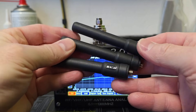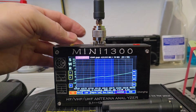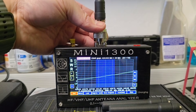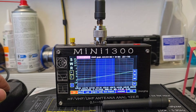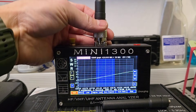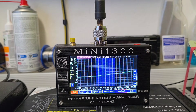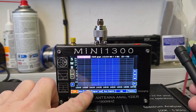Let's see how different three identical stubby antennas are. Antenna 1 on 70 cm — the plot looks the same as before. Antenna 2 on 70 cm is slightly better, with a little lower SWR, though touching it makes it go higher. Antenna 3 on 70 cm is slightly higher SWR again. Overall, all three antennas are essentially the same on 70 cm.